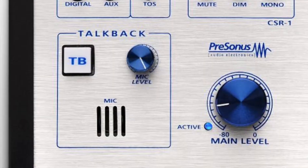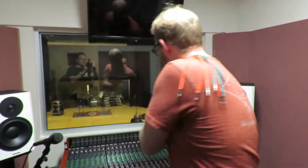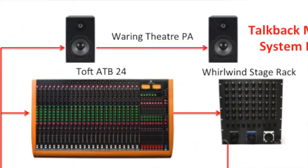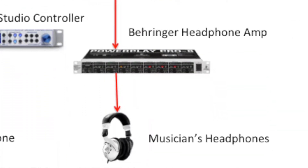When their headphones are off, if I hold the talkback button or use this controller — check, check, check — you can hear me outside in the room. You'll also see on channel 24 my voice going up, because it's splitting the signal: half is going out to the studio live on speakers, and the other half is going to channel 24. So you only have to hit one button — the talkback button — for it to go to both locations.